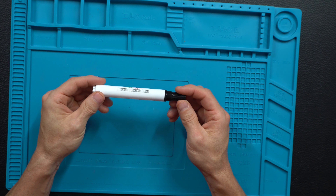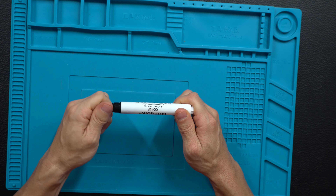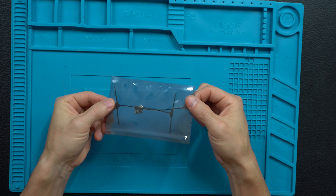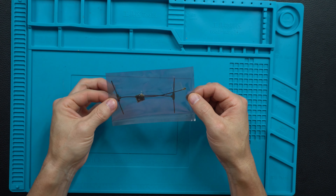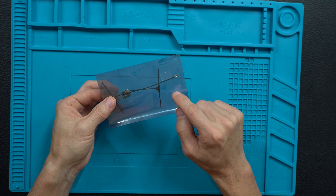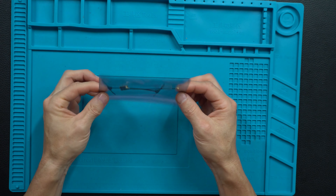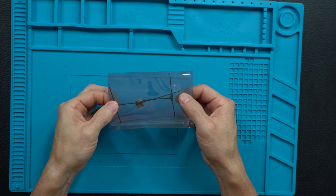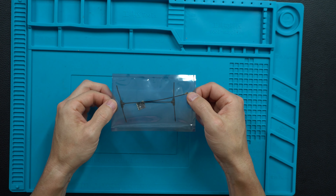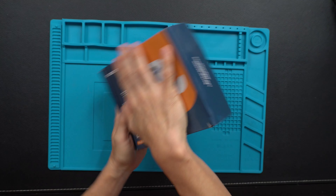Not build-specific, but I ordered one of these flux pens. I always see him using them — I always solder without flux because I'm lazy, so hopefully this will make the process a little bit easier. For the receiver we're doing ELRS. I recently switched over to the RadioMaster Zoro from the DJI controller. If you buy the starter kit you get three receivers — two with the immortal T-style antenna and one ceramic receiver. I put the ceramic one in the Protec 35, one in the Nazgul, and this one's going in the Pavo 25. I want to do real estate or fly through homes and buildings, so I definitely want that strong connection. This is only 2.4GHz but it should be good enough.